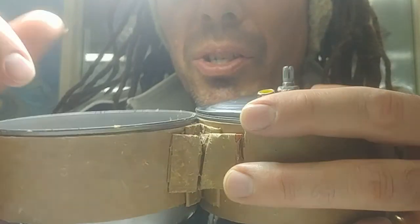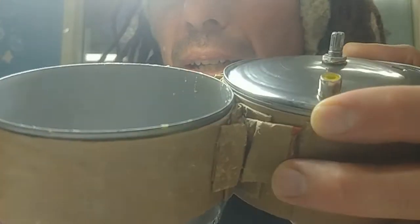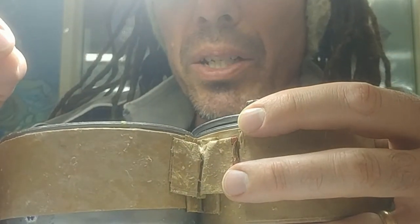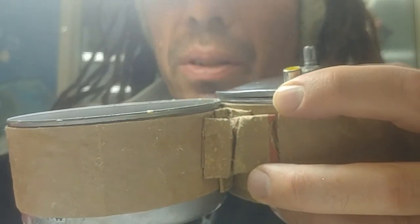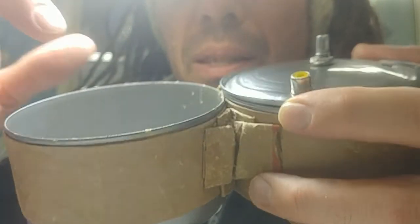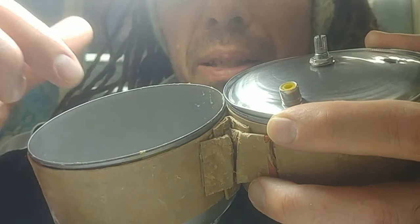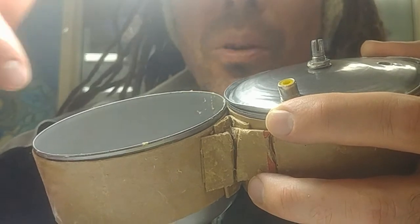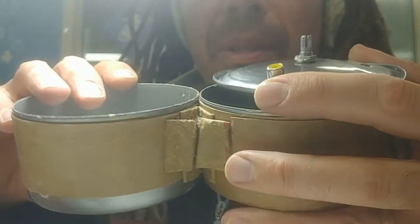Also, that means parts of your circuit — tin cans are lined with plastic food-safe plastic lining — but if you have a circuit in there that has a sharp edge that wiggles and scrapes at it, eventually it will scratch through. So don't ignore that kind of situation. Make sure any pieces that might end up touching the edge are well insulated, either with hot glue, goop, 3D filament, or wrap a piece of paper around the inside of the can to keep stuff safe.